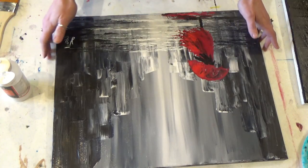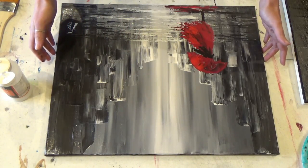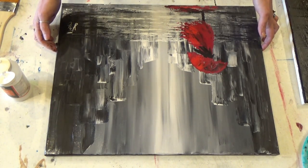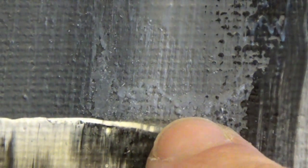And there it is all varnished. You can tell how quickly it dries because over on this side it's already almost dry. I didn't varnish the edges just yet because I just barely painted them and I don't want to streak that black paint around, so I'll give it a few days before I varnish the edges. I overworked a little spot right here — it's kind of chunky and I can see the end of the brush stroke. Because the varnish is still wet it looks a little more milky, so I'll let that dry completely before I decide if I need to put another coat over it. If I can still see it once it's dry, I'll take a very light coat of varnish over top and that should help smooth it out.